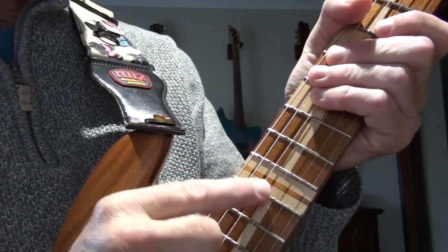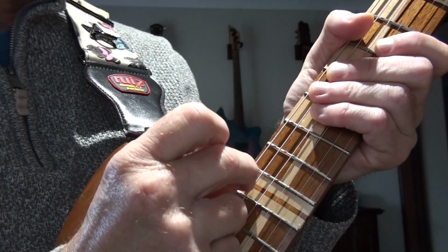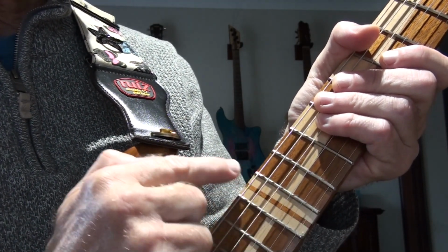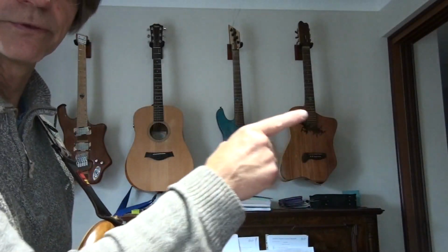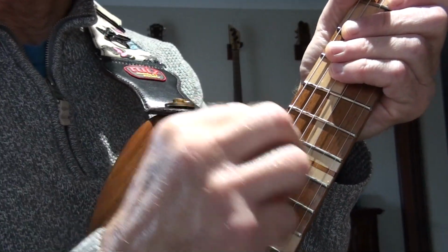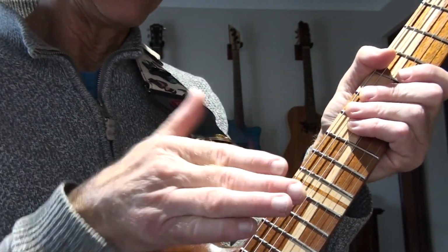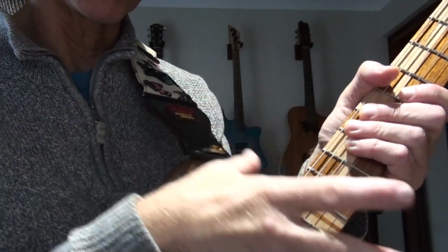This bit here I don't explain very well in the video. I just did a solid piece of maple and then later on I went and cut it out with a fine tooth saw, and I had some 2 millimeter thick blackwood, which I used for the top of that acoustic guitar there, and I just slipped it in, just sand. Basically what I do with everything is I make the slot and have the material slightly thicker, and then sand the material, try it, sand it, until it just goes in.